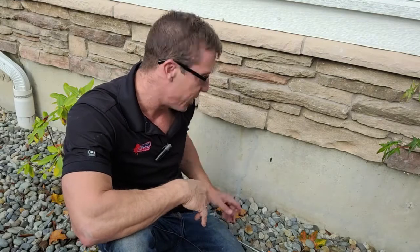Going around the house, looking for all these cracks and filling them up like I just did is really a two-minute job that could save you a lot of problems later on. When we do a home inspection and we see cracks on the foundation, it always stresses the client. And then when we get inside, we look for clues — are the windows and doors square, plumb, and level? Do we have any ceiling cracks or any exposed wall in the basement showing cracking? But if we don't see anything, it still doesn't mean there's not an ongoing problem. So the best way is to seal it, then wait and see if there's any ongoing movement. If there is a problem, you can act on it and repair it before it becomes something very expensive.